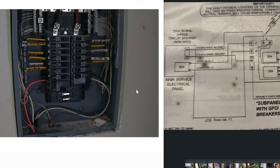Now you can see a nice side-by-side comparison of my breaker box to the instructions. It says the red and blue wires from your 50 amp — my 50 amp is right here with the red and black wire, which is the same thing as red and blue. It also says to have your white neutral wire, which you can see going up to the neutral bus, and then the ground wire going into the ground bus. That's that side, and I'll be snaking it down through my basement.